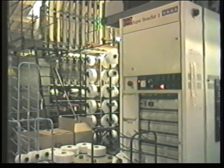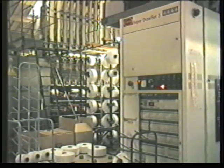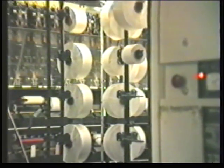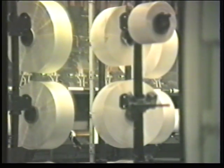For very thick yarns, 3 single ends of yarns can be twisted together to form a three-fold yarn. Synthetic continuous filament yarns, although stronger than natural spun yarns, are distinctly less bulky. A series of texturing processes have been developed to produce bulky synthetic continuous filament yarns without the need to cut and spin. This is a false twist plant.